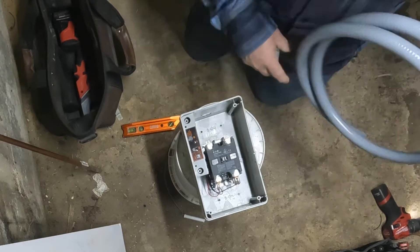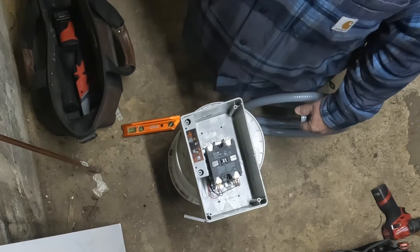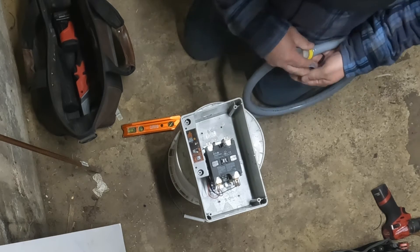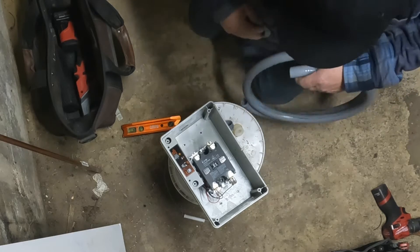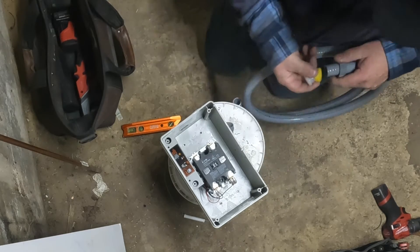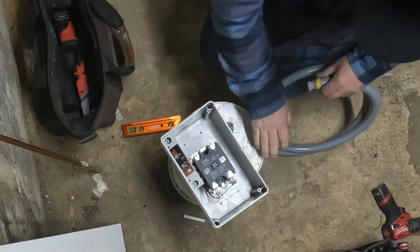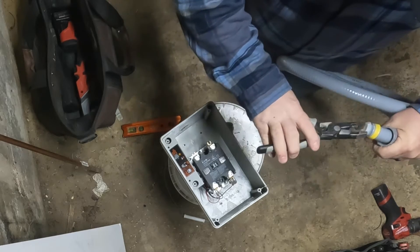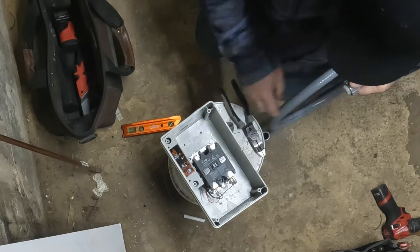I want to connect this end first so I get the exact cut over by the panel. These are the more complicated ones — the non-metallic flexible sealed conduits. These go on here just like this. Make sure you set your lock nut on there. This yellow seal is what keeps the water out, and this piece goes on the inside like this. You could use channel locks — I use pliers, it's just as fast. Try not to damage the plastic when you're putting it in.